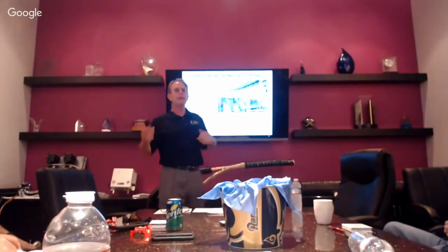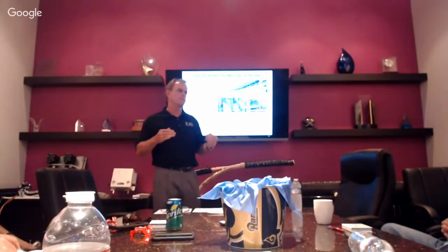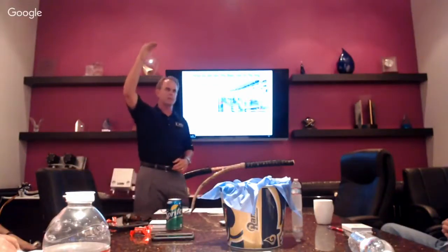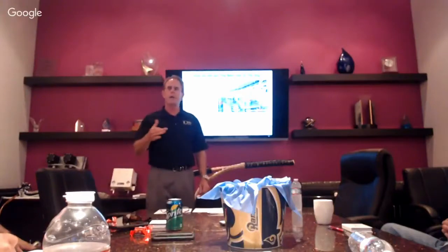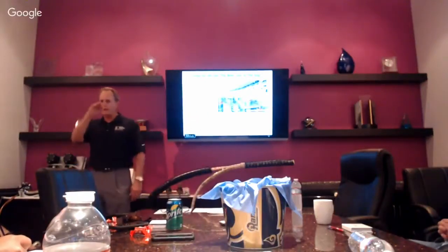Now, if you're doing a mixed gas, you can go up as high as you want because you're actually pressurizing the keg, and you can all factor that into the equation. The biggest issue with that is your shelving. That's always the issue. I want to put my pumps from the bottom of the keg to the center line on the pump. The best place for a pump is 60 inches from the bottom of the keg, 5 feet. We have gotten okay to go up to almost 6 feet. That's about the limit. That puts the bottom part of this panel right about at the top of the keg.